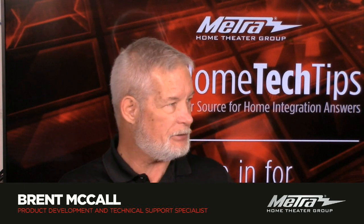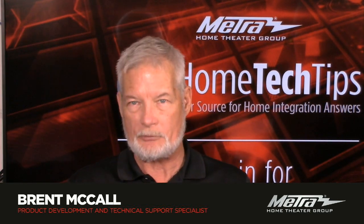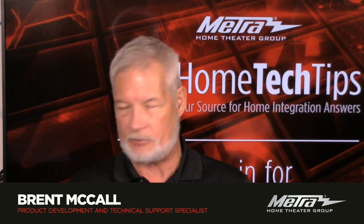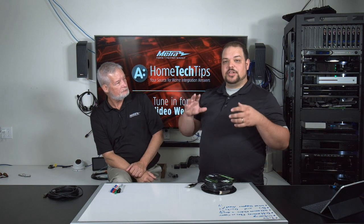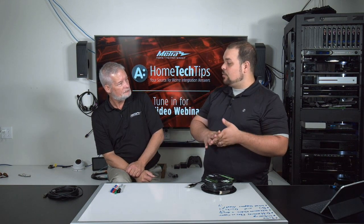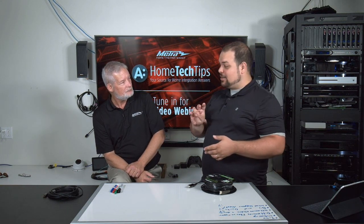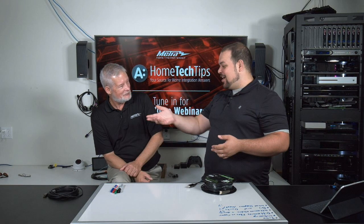You're going to be able to take this cable, roll right into 24 gigabits, which is 4x6 channels, and support the needs that you have in the near future without a problem. So just to review that again, last time we talked about the fact that with the HDMI 2.0 standard and everything before that, we had 3 channels, correct? Yes. And in fact, it worked out to be a red, green, blue channel, and then the clock.